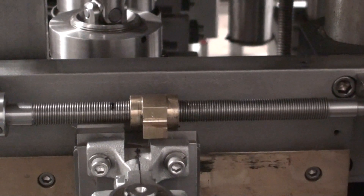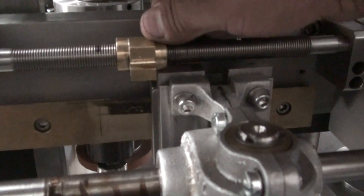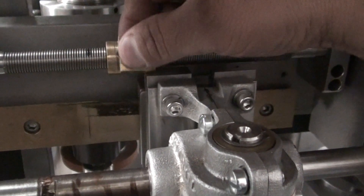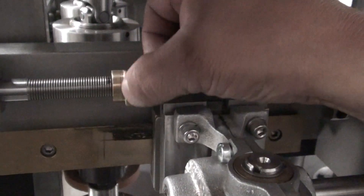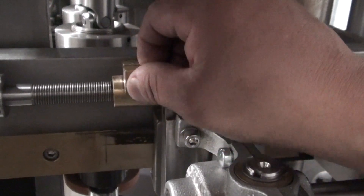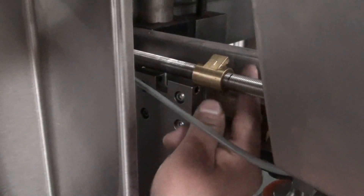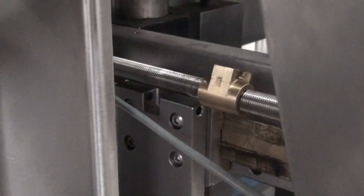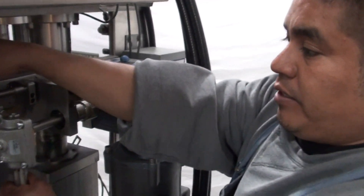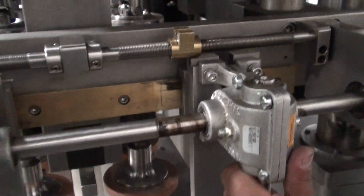In order to move our brass piece, we're going to have to remove our belt out of the way. Once you move your bracket out of the way, you're going to move it just enough to clear this round piece on the brass, and then we can turn it out to the mark that we gave previously. We will repeat the same process on this side and turn our brass piece until we get to our mark. Once we reach the designated spot, we're going to move back our piece so we can make sure it's where we want it.